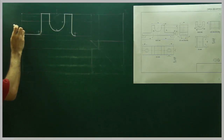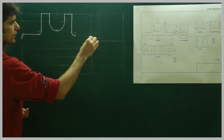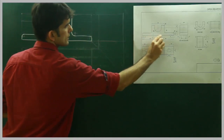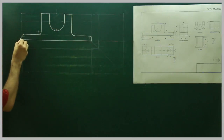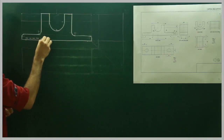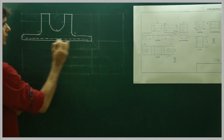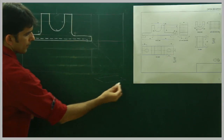It's a semi-circle, like a quarter-circle. Here also we will take 5 on both sides and from there draw this. So first we draw this part. Then they have given this slot — it is 8 on both sides and 4 over half. So we take 8 on both sides and 4 over half to draw it. Now this is the cavity — they are going to remove material here to reduce the weight of the object.